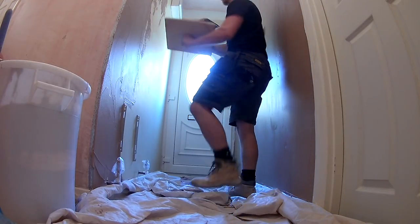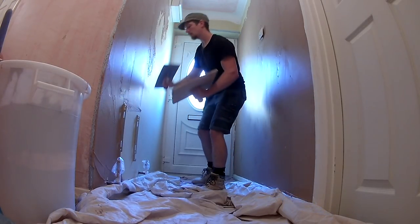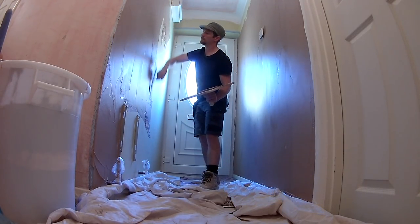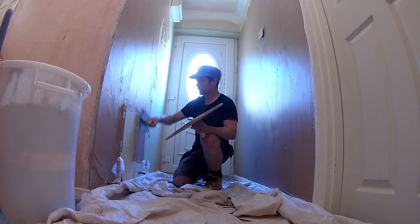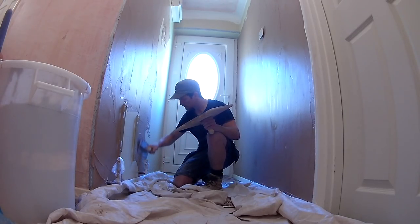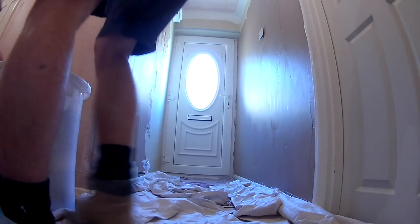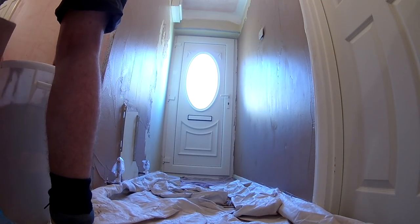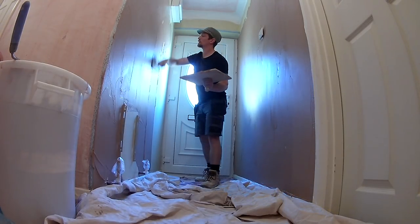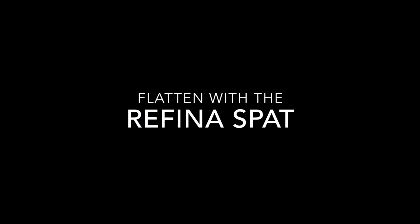In terms of what trowel to use — I've got a little area between the two brackets and I'm going to need the midget trowel. In terms of using a midget trowel when you're applying your plaster, they can be really hard to use at the beginning because they're often not well designed. Midget trowels can often come in quite bad states — not really ready for plastering, quite thick, not bevelled or sharpened. So getting a decent midget trowel is another thing to think about. It's not worth buying a cheap one — just buy a well-reviewed one that's worth your while.